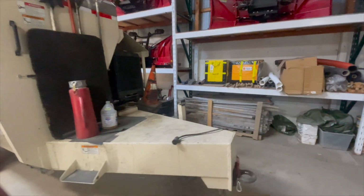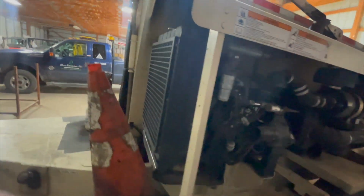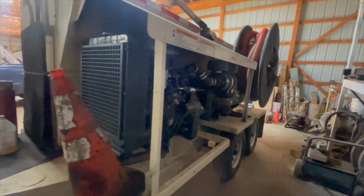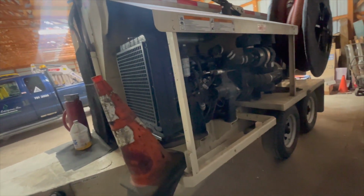See you next time. All right, to wrap up this video on the Bark Blower, it's now July 3rd, '22, and I started filming this back in March. Anyway, we got it all back together. It's all in one piece. We've run it for 3 months, and as of right now, the coolant's green, no black in it, no more oil. So we're gonna chalk this up as a proper diagnosis that the head gasket was in fact bad, although it still spits and sputters and pops and blows whitish blue smoke. There's no oil in the coolant, which is good, and the system's staying pretty clean.